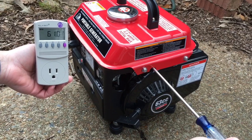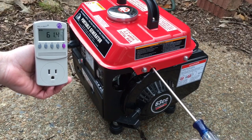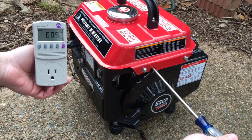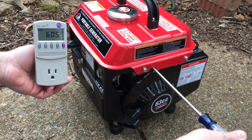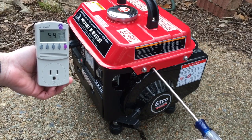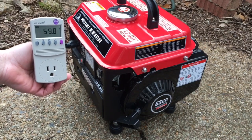You're going to want to get this down as close to 60 Hz as you can. 59-point-something is fine, and up towards 61 is fine — just don't go too high. You'll hear my engine has slowed down now. I'm at about proper speed, which is another sign that you need to adjust it when your engine starts getting louder.